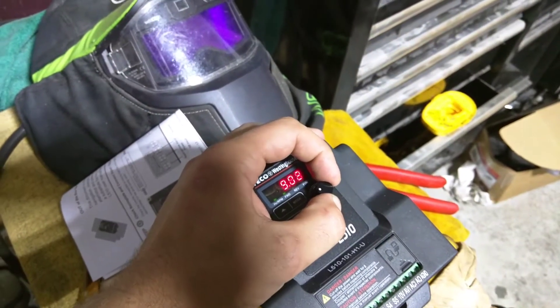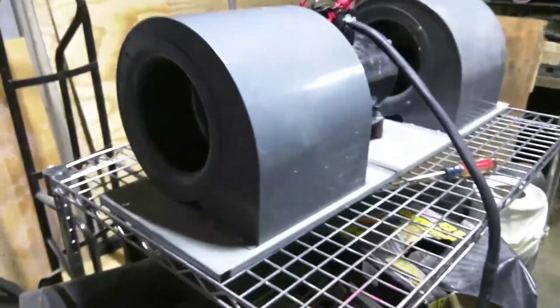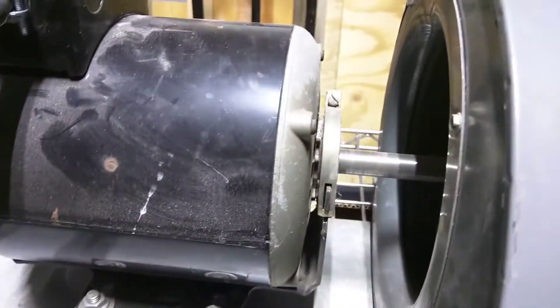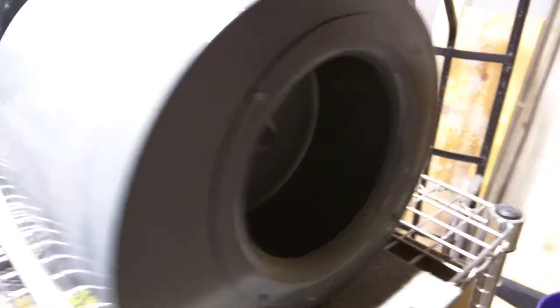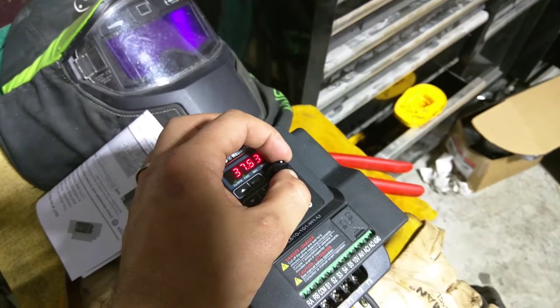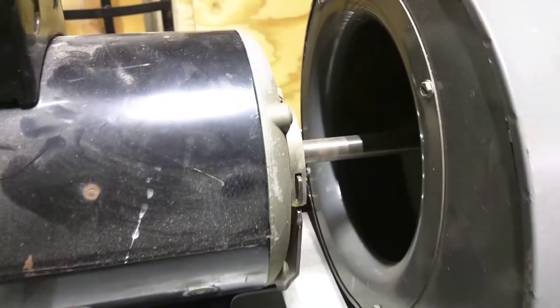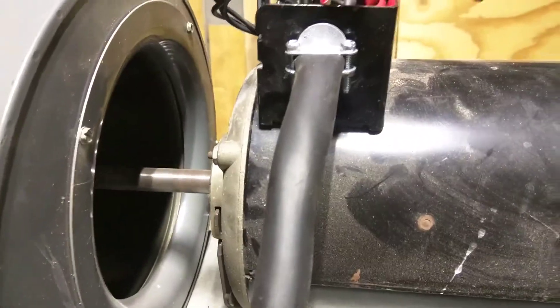You can adjust it — since this is a 60 Hz motor, let's set it to roughly 20 Hz. I can't really show you how hard it's blowing, but it's turning faster and you can hear it. You can certainly see it. We can turn it up to two-thirds capacity — turning a lot faster, maybe you can see that. It's super smooth. It vibrates a little at this RPM, this 40 Hz, but it's pretty good.